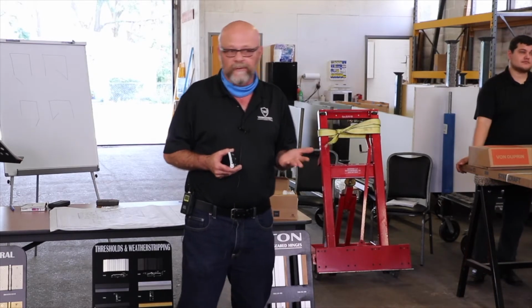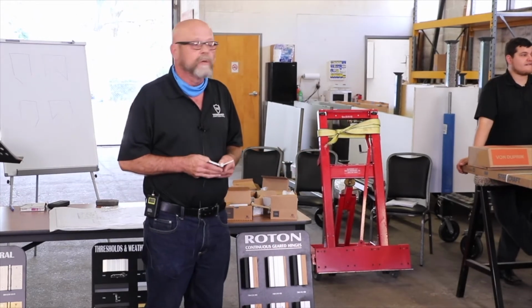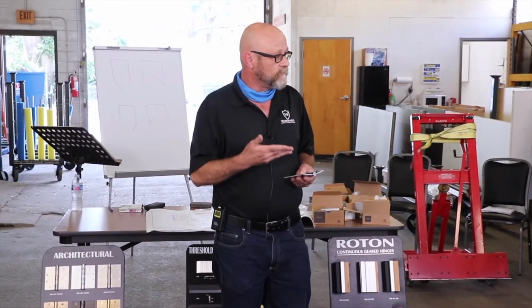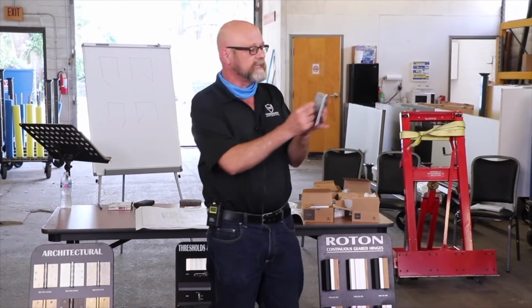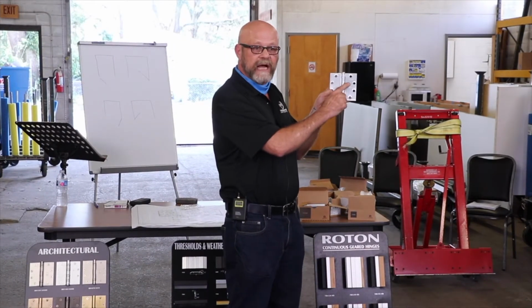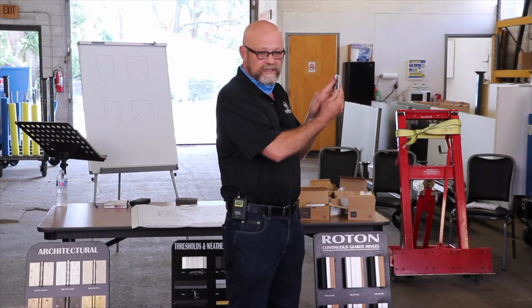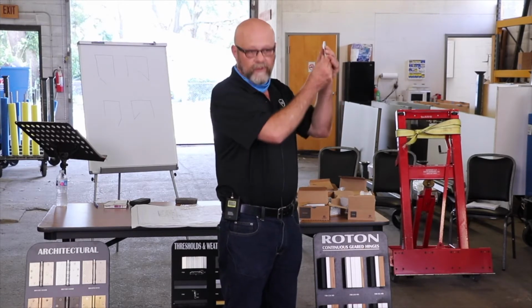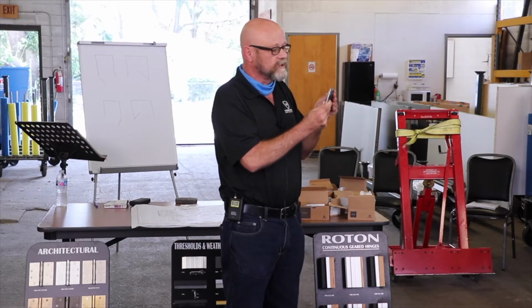But it's another option they put in there. They'll put security studs in them. Sometimes if you're working in the military base, I'm sure you've seen where it's got a little point out here and then a hole on this side of the hinge. That's a security hinge. That's just another way to make sure if they get that pin out, they're not lifting that because everything is interlocking in there.